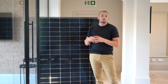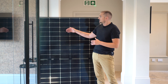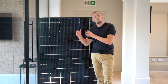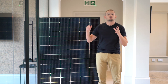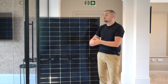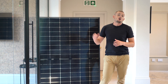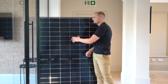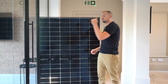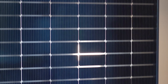In terms of construction, from the front you have a single glaze sheet, receptors, and an aluminium frame encasement — much like any other panel. Where this panel differs is at the back. It's a bi-facial panel, meaning it has receptors on both sides. It captures light on the front but also on the back. The clear intermediary sections allow light to pass through so it can be harvested and converted to energy on the rear side.